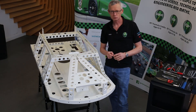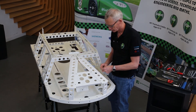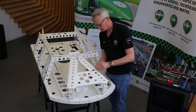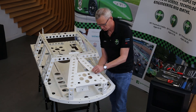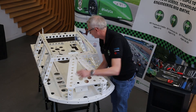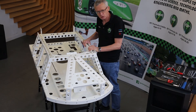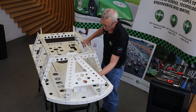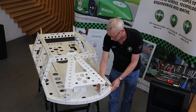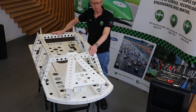Now we change tools to a 3mm allen key with an 8mm spanner on the back for the remaining bolts. When you think you've finished, give the chassis a shake — if there are still rattles, you've missed something. There was some rattling at the front, indicating two bolts still needed doing up. And there we have our almost completed chassis.